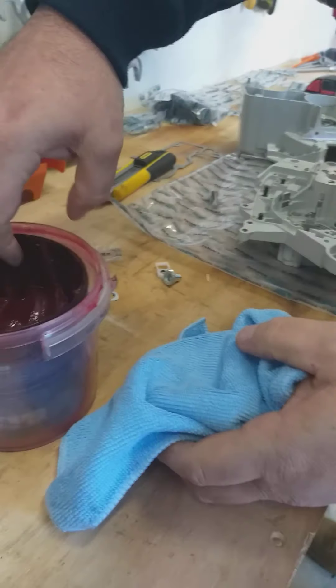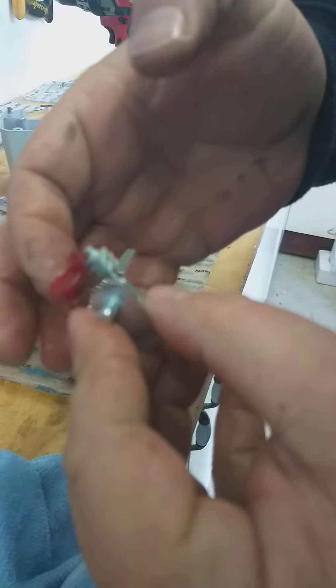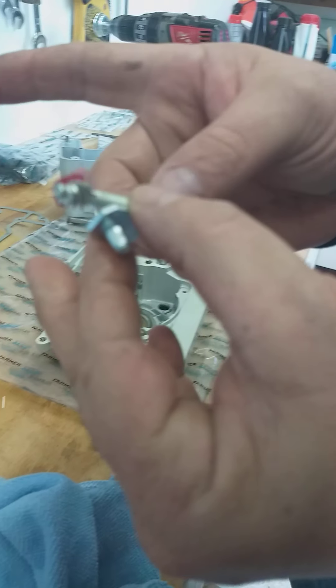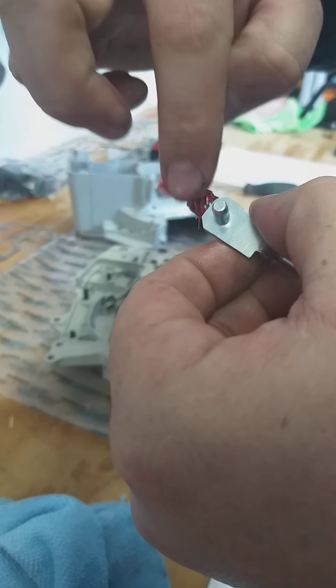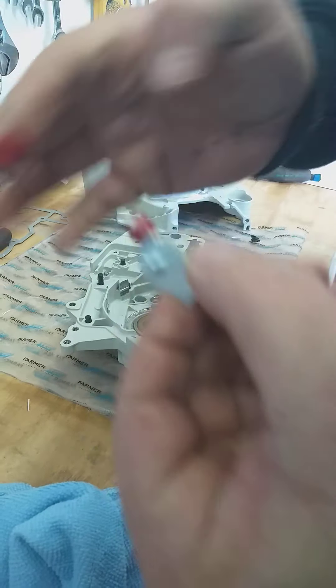You don't need a lot, just need a little bit - just got to cover the gears. You don't need to bother covering the screw because that will be covered in bar oil when the saw is running. But you want to give the gears a nice grease. You don't need a lot, just a little bit.